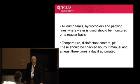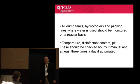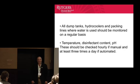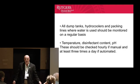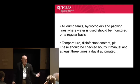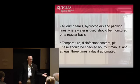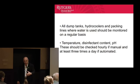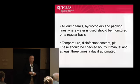If you take a test and it's bad or something, is that public knowledge? You pay for it, or you keep it? You keep the knowledge. If you really have a problem, you're not going to be able to have a clean test at some point. But if you have just an issue like it just happened to rain, you pull the sample, the level's a little bit high, you go back a week later and the level's down, you're okay. Some states allow you to have some highs in there as long as your mean is okay. But certainly if you're able to pull multiple samples, or you know you might be right on the edge, pull another sample a few days later and see if you're underneath.